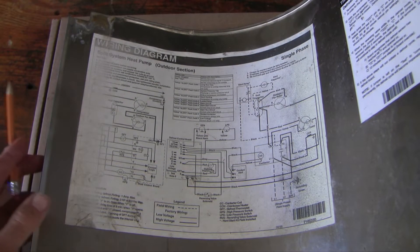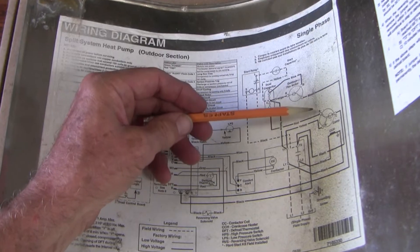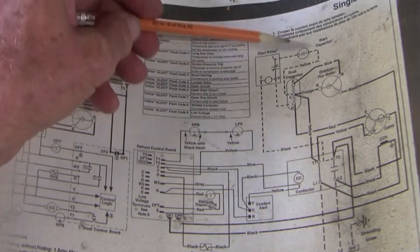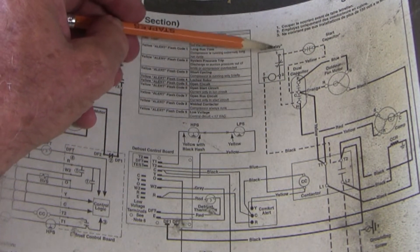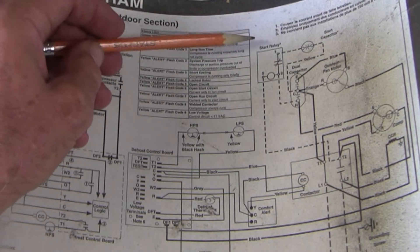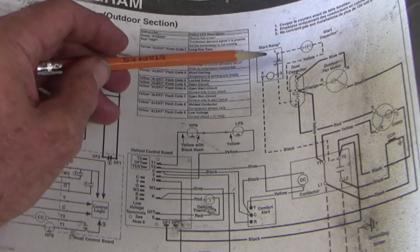Here's the other side of this metal housing — an excellent wiring diagram, easy to read. Power comes in to the contactor, and from the contactor power goes to the hermetically sealed compressor motor and the fan motor. This is the dual run capacitor right here. There are optional accessories, including a 5-2-1 relay — a potential relay. There is no start capacitor and no potential relay on this system, so I'm considering whether it might benefit from the addition of a potential relay and start capacitor.